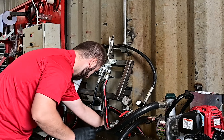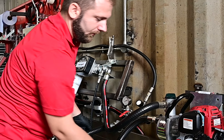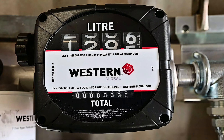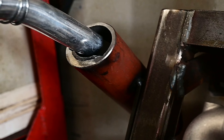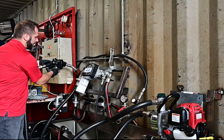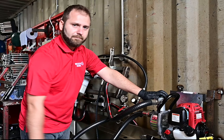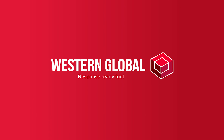Let's see if that did the job. Sometimes there are air pockets and we'll have to do this again, so don't get discouraged if it doesn't work the first time around. I've got my fuel on — let's see if we can get it started. I hope you found that useful, and remember, if at first you don't succeed, try again. Sometimes it takes 2 to 3 times to get a pump fully primed. Thank you for watching, see you next time.